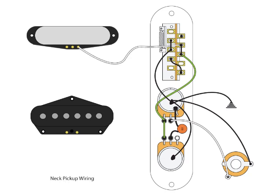Next, we start wiring the pickups, beginning with the neck. Your pickup wires might be different, so check the manufacturer's specs. In my case, the white wire is the hot — take that and wire it to lug B2 on the switch. Then take the black wire and go to lug A5 on the switch. If you severed the chassis ground for the pickup cover, take the yellow cable and run that to ground. If your neck pickup does not have a cover, you only have a hot and a negative wire and don't need to worry about the cover ground.